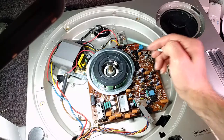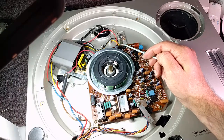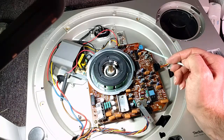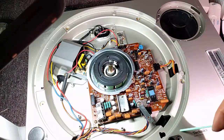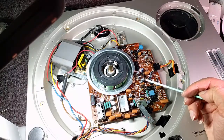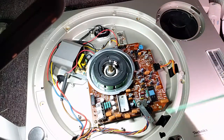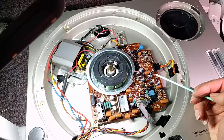The plug here for the LED — I've removed the LED completely, it needs some work. The plug is isolated completely; it's a 21-volt and ground deal. There's a 1.5K half-watt resistor in line, stock, which goes to the lamp — that knocks it down a bit, but it's a pretty high-voltage lamp on a high-voltage rail. What I want to do is put a buck converter to give it like 5 volts or 3.4 volts, using the plug going from here to the buck converter, then make my own plug going to the LED array. Obviously fuse everything, and I should be in good shape.